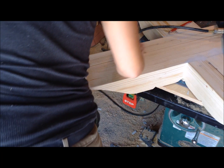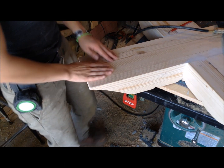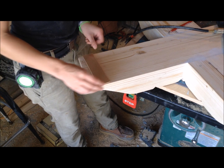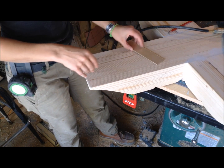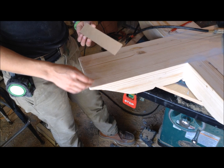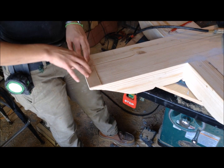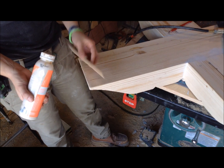While I'm waiting for my table top to dry, I'm going to be working on my pedestal because there's still some stuff left to do to it before it can be stained. What I'm doing is adding eighth-inch chipboard pieces to all four corners, because the chances of the base bottom being perfectly flat on the floor is pretty slim to none, and taking the time to try and do that is just not worth it. So in the corners I'm adding this little eighth-inch piece that you really won't see once it's sanded over, and the table will sit on these raised pieces so you won't have to worry about it rocking.